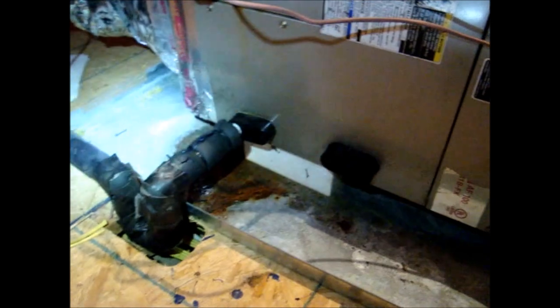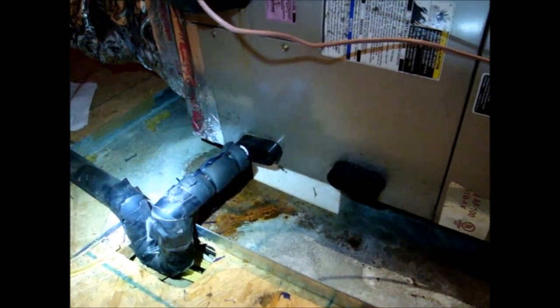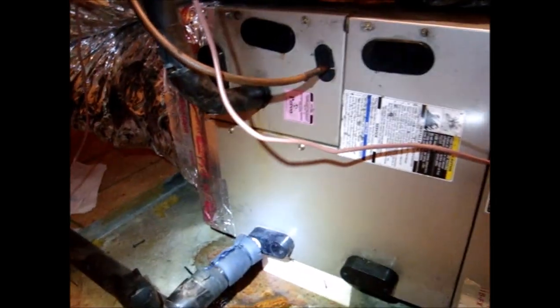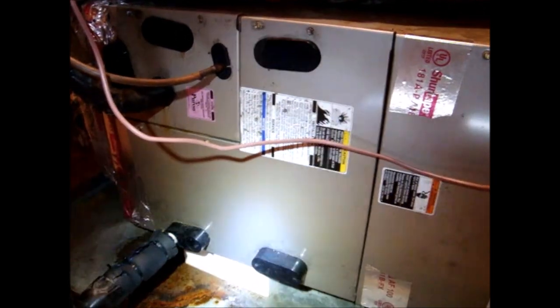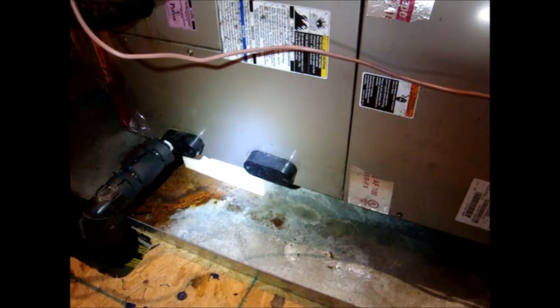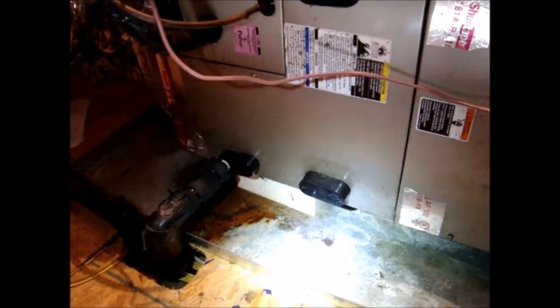Everything is finished out here. Units have been running, draining. Got our Armaflex hooked back up, drain line hooked back up — just a coupling. Taped up where the filter door was, which was like that previously, but I cut all the tape. Wiped a lot of that mildew off the doors. Had to put some AF100 metal tape on there because the insulation on this door was pulling off and I didn't want it to completely rip. Vacuumed the water out of the pan. I think I'm about to wrap this Friday up — it's almost beer thirty. Thanks for watching, and until the next one.